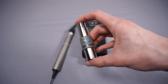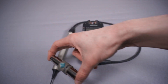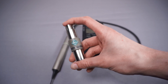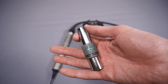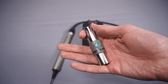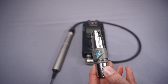If you're using a mix of microphones it becomes trickier. If you bought the original Fethead and wanted to use a condenser mic, you'd need an external way to power it. If you've got the Fethead Phantom, you could only use it with a microphone that can at least survive phantom power — it doesn't have to use it, but it can't be damaged by it. Ribbon microphones, for example, can be damaged by phantom power, so you need to be very careful.